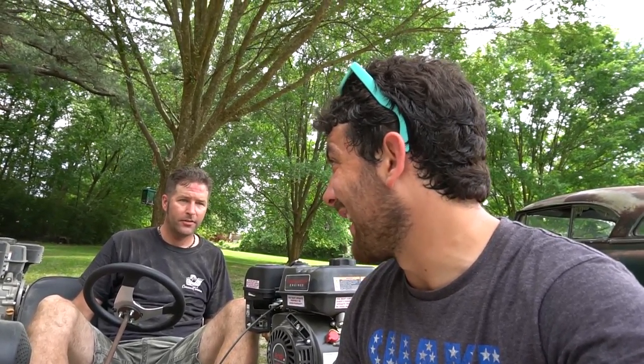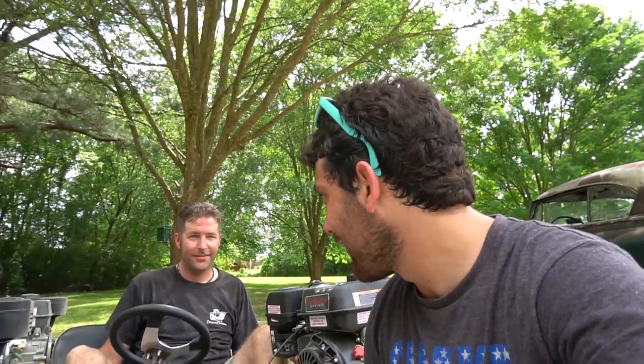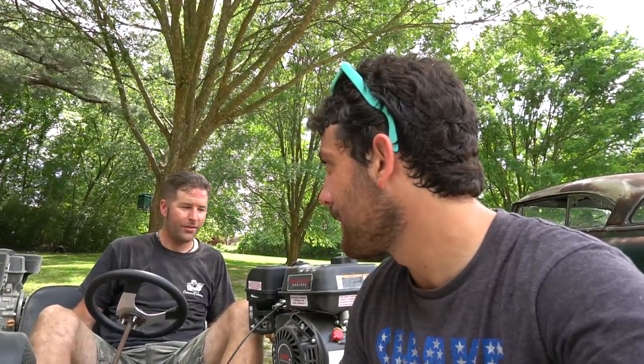What do you think? I'm happy. But we need some tweaking, but we'll get it. Yeah, a lot of going backwards. Fixing the rear camber is going to be a little bit of a big deal, because we're going to have to cut stuff and just bend it back. Not going to be a big deal. Bend it back? It's just going to keep bending. No, not if we put the strut things like we did on the front. Oh, true. It'll be fine. All right, we're just going to bend it back then.